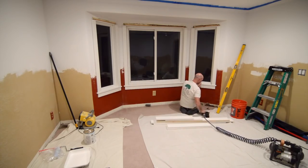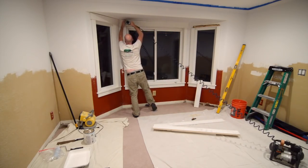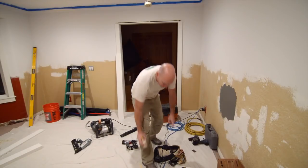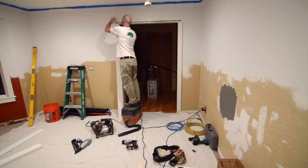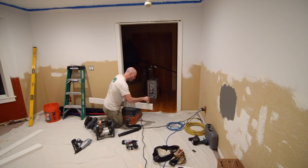For this type of work, I like to have the smallest air compressor that I can buy — there's a tiny little Senco air compressor over in the right-hand corner and it's perfect for this kind of work. I'm switching between two nail guns: a 15-gauge angled nail gun made by Hitachi that has been an awesome tool, and an 18-gauge Porter-Cable nail gun that shoots up to two-inch 18-gauge brads.